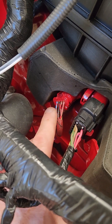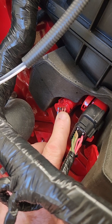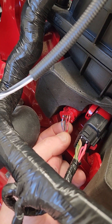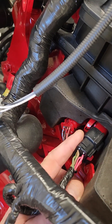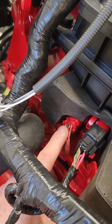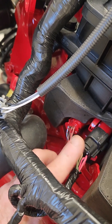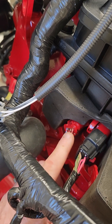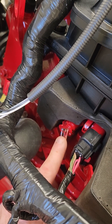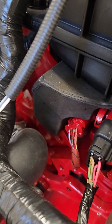This is a four-wire sensor, so this has both pressure and temperature — reading the rail pressure and the rail temperature. This harness is a four-wire GM harness plug. The Volvo Penta harness plugs into this main harness, but one wire goes nowhere — it's blank in the plug and does not connect to the Volvo side. So the temperature portion of the circuit does not work on this application. I'll show you the color codes for that. We're going to look at the later model engine now, which only has three wires.